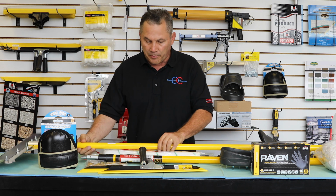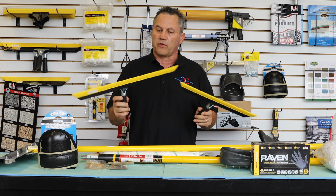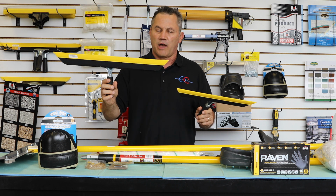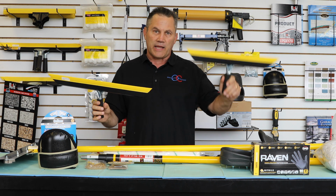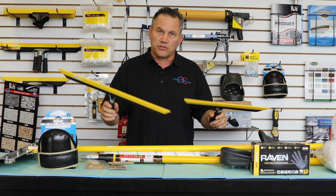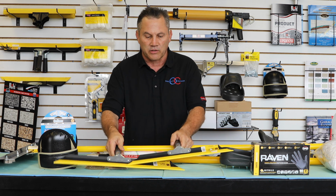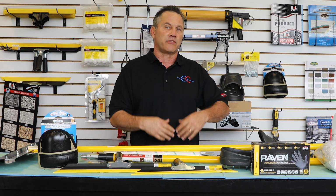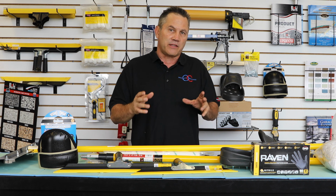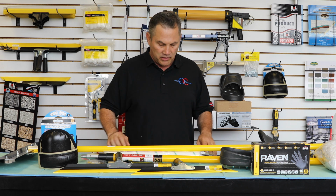And then stepping down from there, the magic trowels, and again these come in different sizes. You have a 22-inch, an 18-inch, what's called the magic trowel squeegee. This is used for spreading your epoxy. Epoxy is very thick and it doesn't roll easily, it doesn't spread easily, so you want to get the epoxy put in place out on the floor before you start to roll it, and this will help you do that.